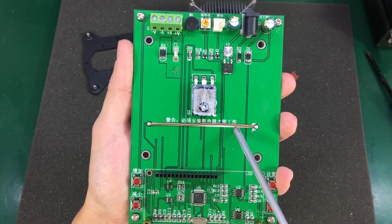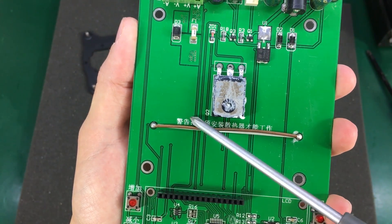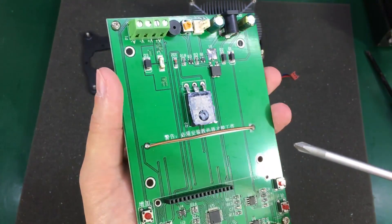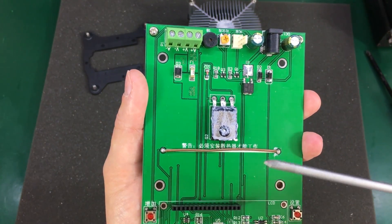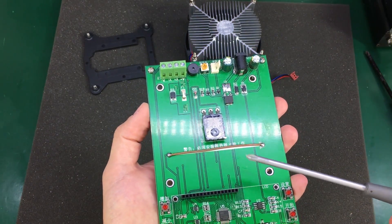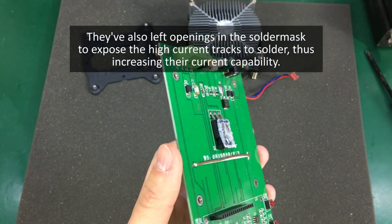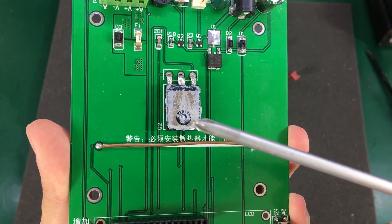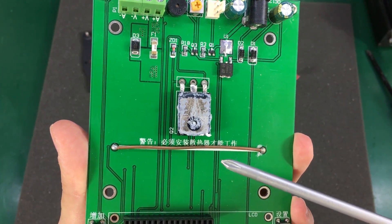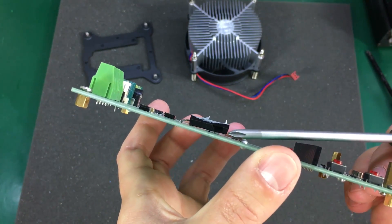The first thing that strikes me is the shunt resistor — it's very long, looks like they're using a long piece of copper wire for this. I like how they sandwich the MOSFET between the PCB and the heatsink to get maximum power dissipation. The PCB is filled with copper to dissipate some heat. There are pads labeled NTC that align with the hole on the MOSFET package — they've placed the thermistor for temperature measurement right in the mounting hole of the MOSFET. That's a really nice idea.